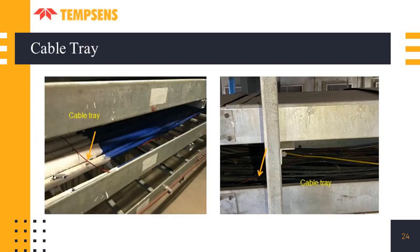Another example of DTS installation: the blue and white power cables are high power lines installed inside a cable tray. DTS cables have been installed alongside to monitor the real-time temperature of the cables. In case of any heating, short circuit, or other issue, the location and temperature of that point can be determined.